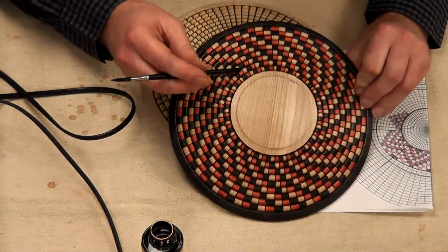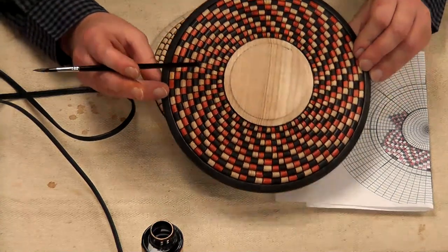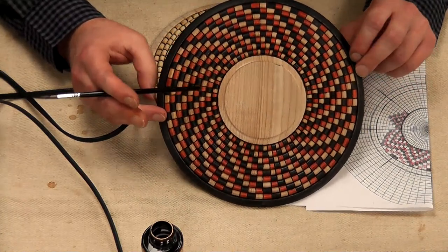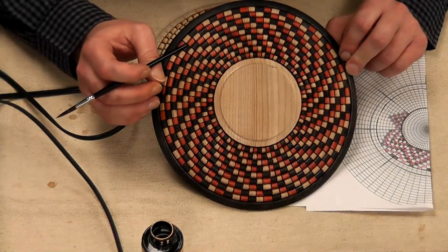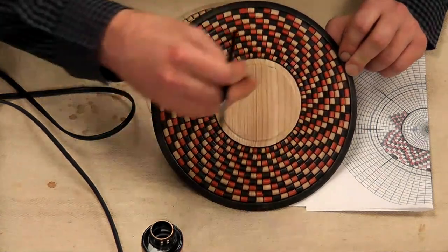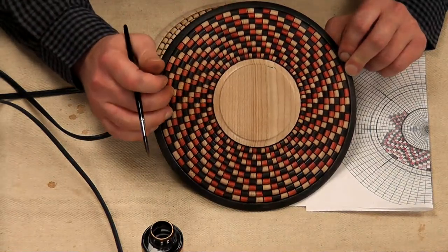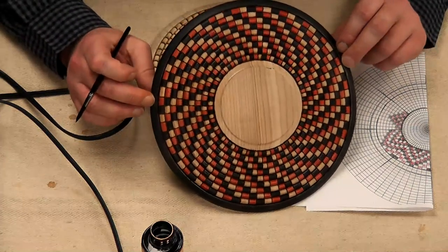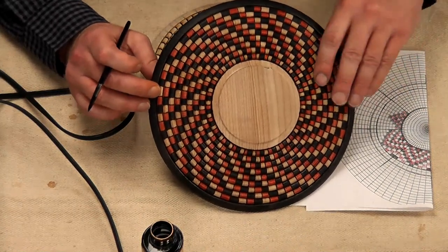We've got a black and a red, and then that's the natural color of the timber, and that's kind of bringing that out as well. So I always tend to use a finishing oil, and that's easy to clean up as well. Again, we've got all these little valleys, so it's almost like you're dry brushing it on. So a little bit of product, get it in there, work it around, but we don't want to flood this with an oil, because you'll spend forever trying to get it back out of these little low spots, and it'll go sticky if there's too much product on there and you can't wipe it back.